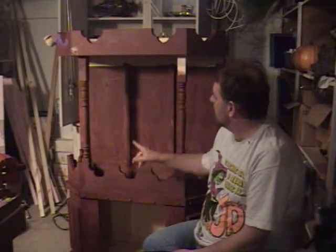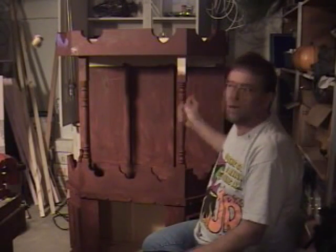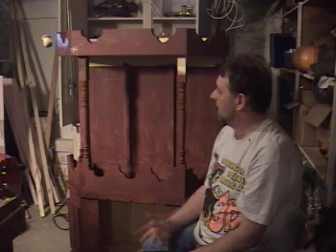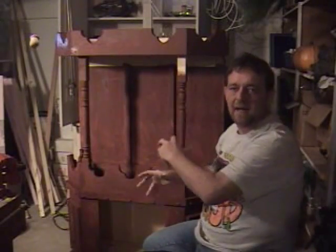I've put on the first coat of a burnt sienna from the red family - I just went to Menards, looked through the mistints and found a color I liked. I'm not real sure I'm going to put a second coat on because the whole idea is we want to age it and make it look super old. You can see from the camera it's blotchy as the one coat went on. Next I'll mix up a darker watery liquid that I'll brush on and wipe right off to give it an antique effect. First I flip it upside down to get all the hard-to-reach parts, then flip it back up, finish the one coat, and start to darken it.